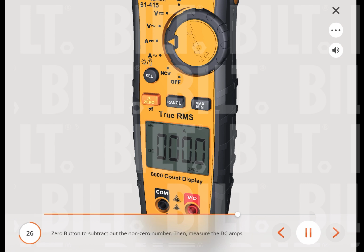Press the zero button to subtract out the non-zero number. Then, measure the DC amps. Pressing the zero button again causes the zero to flash and the original offset number to be displayed. Press the zero button to exit this mode.